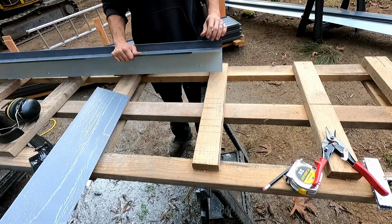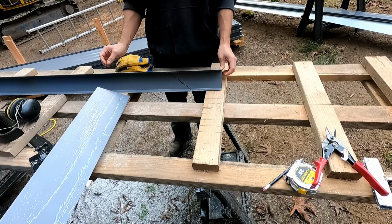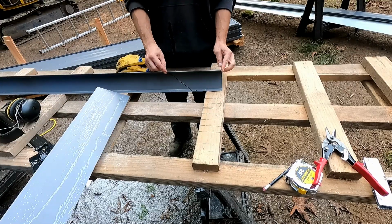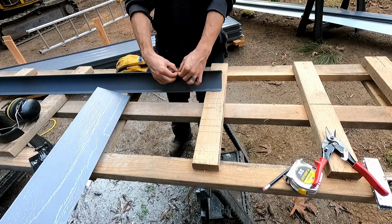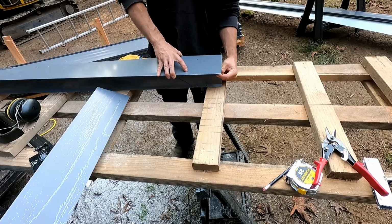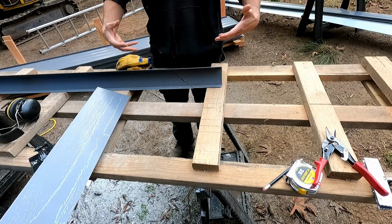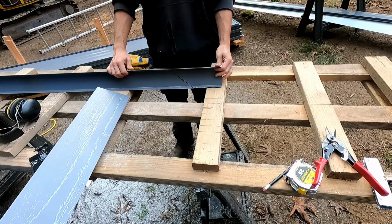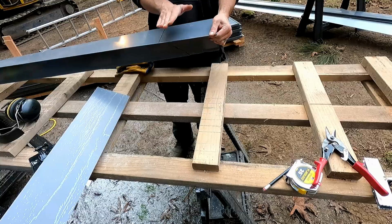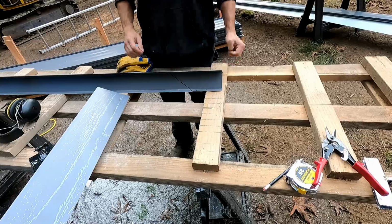There's a little hem here. And then these are the holes from the rivets that held it together. And then this is the amount of overlap. I marked it up there so I could see. And this fold here gets crimped tight so that it's as small as possible and it can fit inside the one that's there. And the one that's there got worked open a little bit so that these telescope together. And the slope is this way, so when any water gets on this, it runs down. The other piece is on top and outside of this, and it shingles to the outside of the roof system.